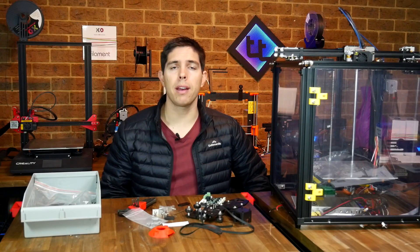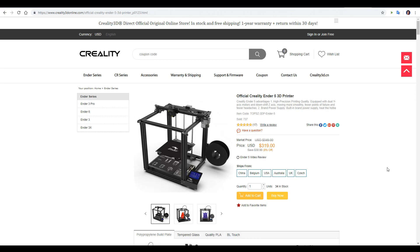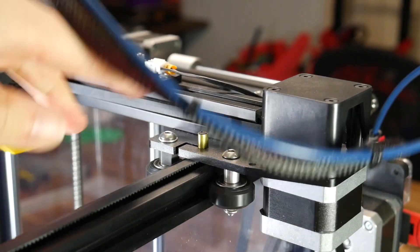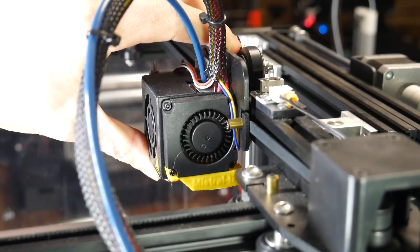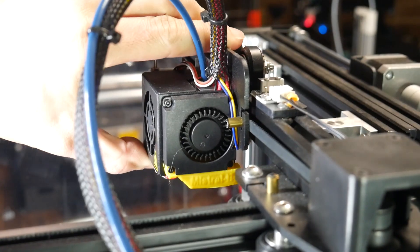Let's start this video by looking at the product and addressing the problem that it's trying to fix. Many modern 3D printers run on V-slot extrusions. The linear carriages that give our printers motion are mounted on special wheels that ride in the slots. Here it is in action on the Ender 5. When we look at the X-axis, we come across, in my opinion, the main problem — the amount of play even when they're tensioned and tightened correctly against the 2020 extrusion.